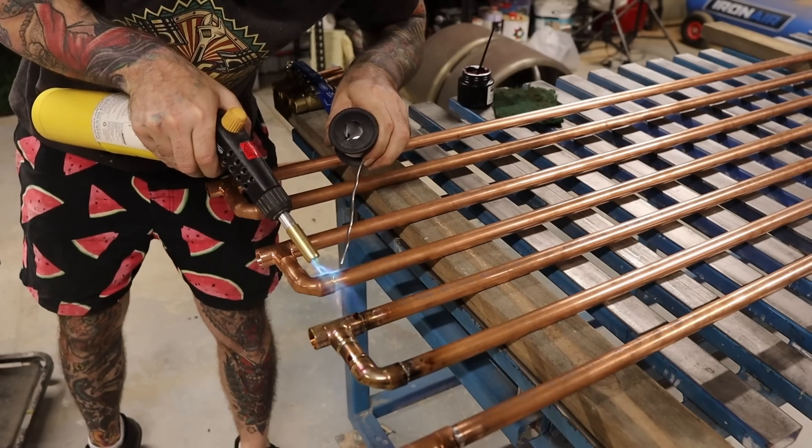That is all mounted and connected up. I ran the compressor about eight cycles — there was a little bit of water caught in the first trap, but because it goes through the water separator first I think the majority is getting picked up by that. It doesn't seem like a very humid day so it seems pretty dry. I probably won't really know how well it works until it gets more humid, but for the most part the air did seem nice and dry coming out the air hose when I was using it. I think it's going to be a nice addition.